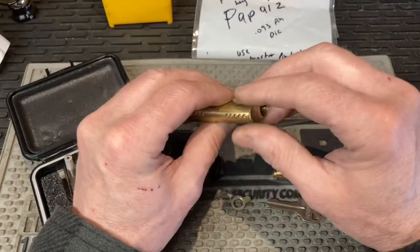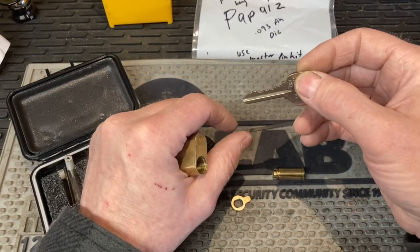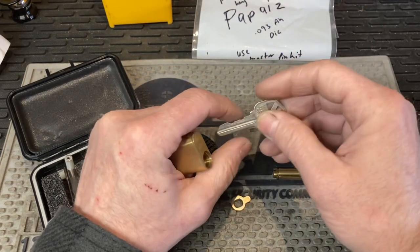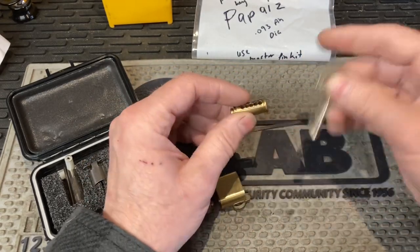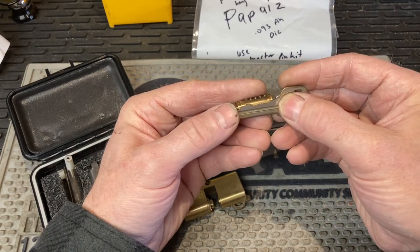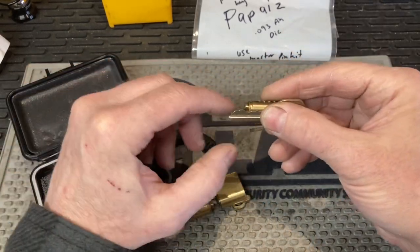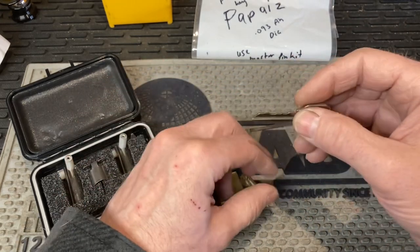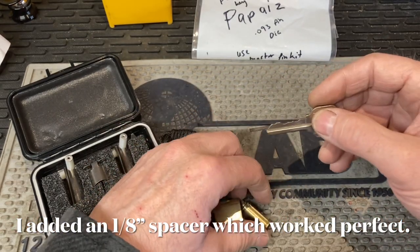The only reason I had to do that was because they had a whole bunch of Defiant locks in their house, and they wanted those two profile cylinders to match what they had. I made it and it worked just fine. The reason I had to put that piece in there was so that the key itself, when it bottomed out into that, was pushing in better. As you can see in the video when I was showing it — with the key working it wasn't catching the back very good. It had to actually push that little plunger in enough to where it would fall into the recesses inside the lock itself.